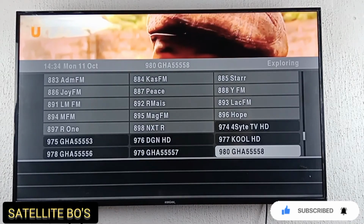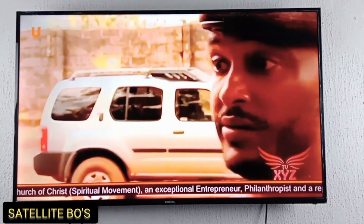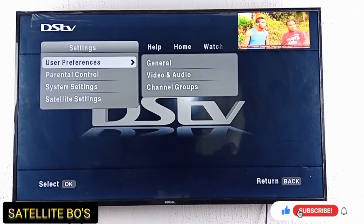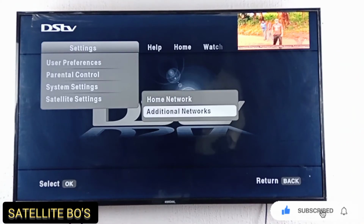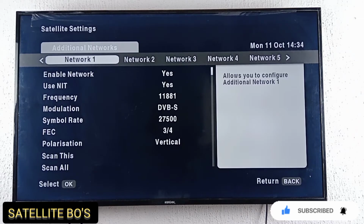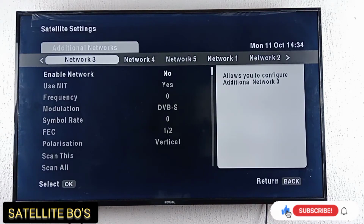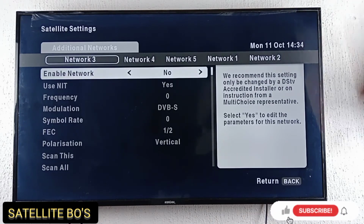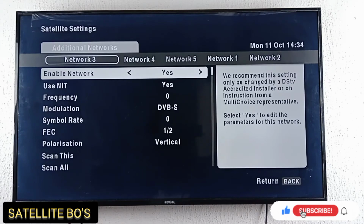So what you do now, return back to the settings again, all right? Press your menu, go to settings, go to satellite settings, go to additional networks. Now, this time, not network one, not network two, because we've already inputted those. Now, go to network three, all right? Now, pick a different frequency. Another frequency we wrote down was 12605 V 29999. As usual, go to enable network and say yes, I'm enabling my network.